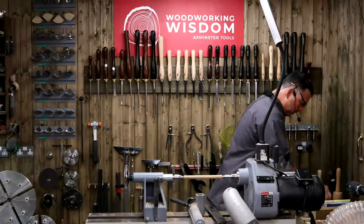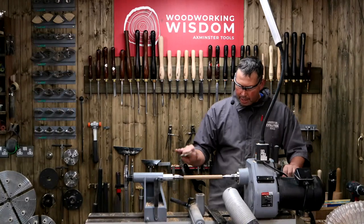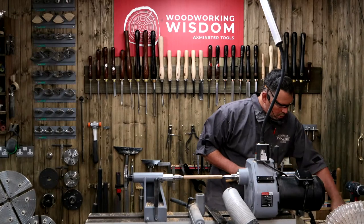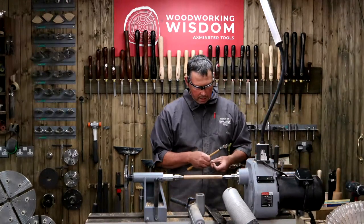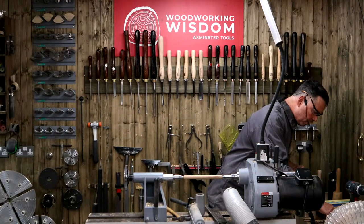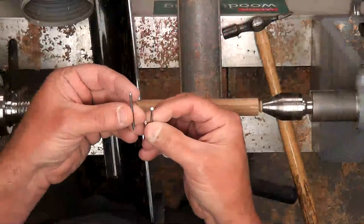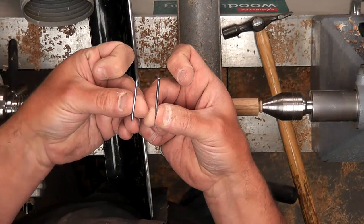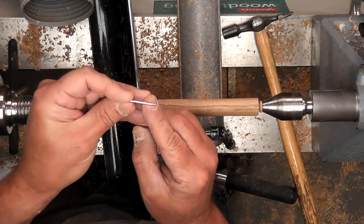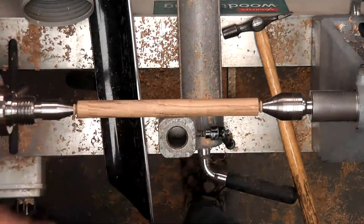So there, now we're just going to give that little area a rub down, just so there's no breakout on the back. And then whilst that's on there, might as well use the lathe. So what I've got is you use whatever nail you have, whatever size you want. All I've done is de-headed an old masonry nail, okay? Sharpen the tip. So we've got an actual scribing cutting tip there instead, okay? And that's all that's needed.